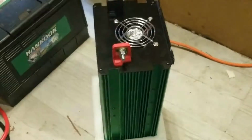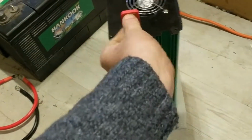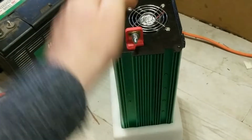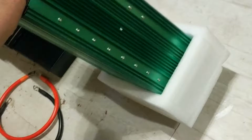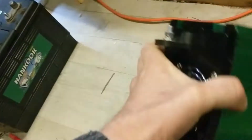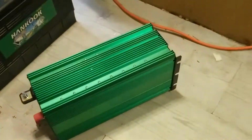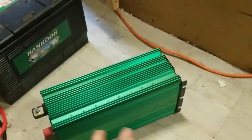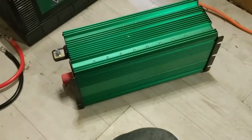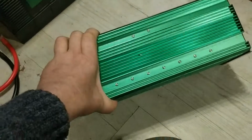We have decent terminals, not little plastic piddly screw things. We've got terminals, proper ones, on metal bus bars that are going to go through the thing and power the gubbins inside. Look at all them screws. Now, when you're buying, I'll give you an education on buying inverters. One, buy them on weight like a sack of spuds. Decide what size inverter you want, and then see what the average weight is for that kind of size inverter, and then buy heavier, because that means there's more guts in it, so it can do more and last longer.